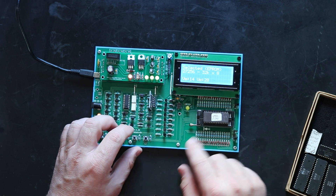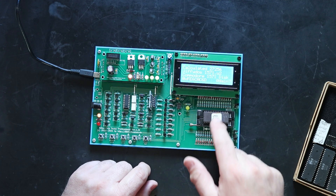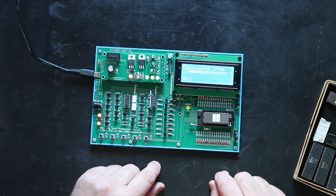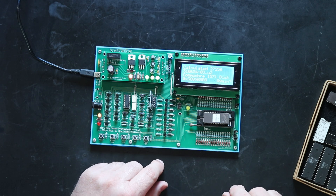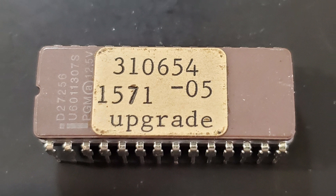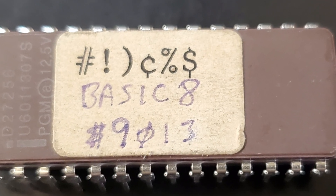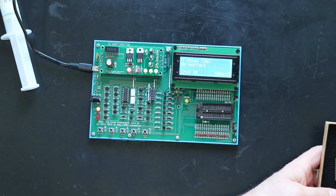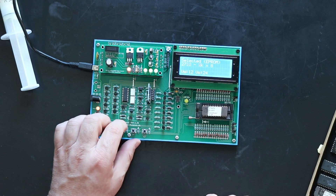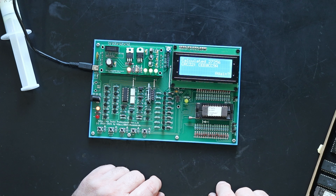These chips are from the 1541 and 1571 drives. This one is labeled 1571 JiffyDOS — let's see if it recognizes it. JiffyDOS 1571 U2: the chip is good. There's also a 27256 labeled 1571, and Commodore 1571 310650-03. There are a couple kinds of EEPROMs: ones with Commodore ROMs burnt on them, and program ROMs for the Commodore 128. The retro chip tester recognizes Commodore EEPROMs and even JiffyDOS EEPROMs, but for the program ROMs it just gives a CRC code.